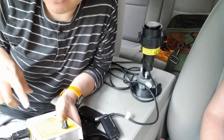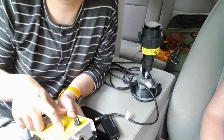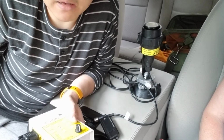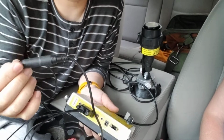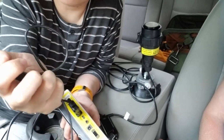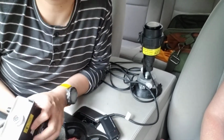And when you're driving the transect, make sure you double check the standby light every once in a while to see if it's flashing. If it's not flashing, that means there's no GPS information, and it's probably that the cable connection is bad. Sometimes, you can see those cables that have connections in the middle, just squeeze them, make sure they're tight. Sometimes they just don't stay the way they should be. So that's pretty much it.